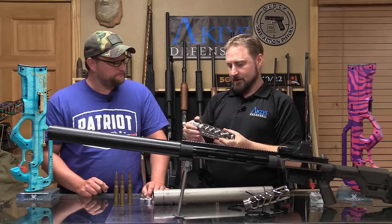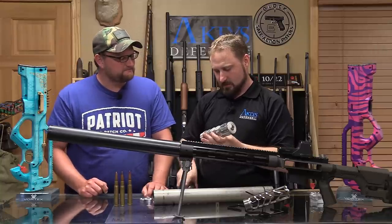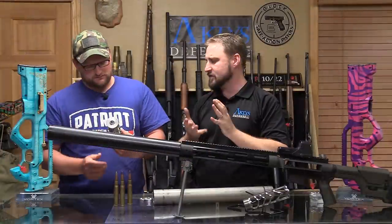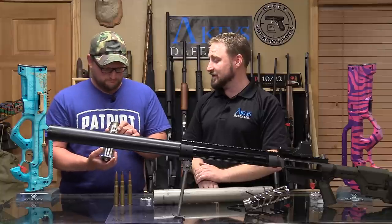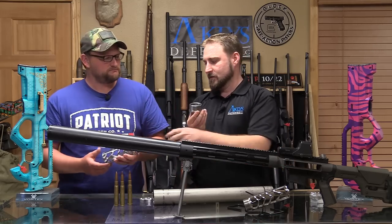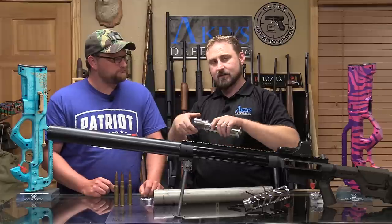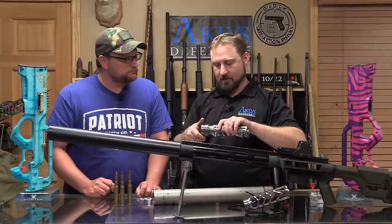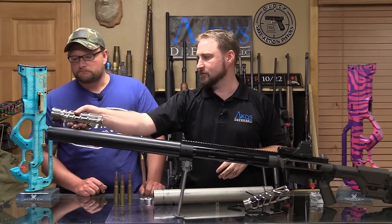That is a gnarly piece of hardware. It starts at about 126 ounces of steel — in this particular case it's 17-4 stainless. When we're done with it, it's about 24 to 25 ounces. So you can see there's a lot of material coming out of that. It's a significantly long cycle time — about a six-hour cycle time. And then the end cap: because we have to have some way to interface it in here, instead of just having a threaded area and solid, we have the end cap to give us an additional airspace. The more volume we can fit in it, the better performance we get. The end cap also holds the whole thing together — the sleeve goes over it, the end cap holds the whole game together and seals it.